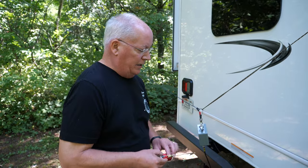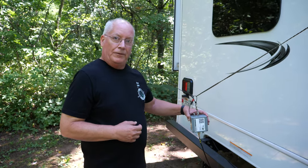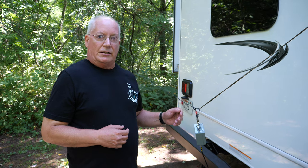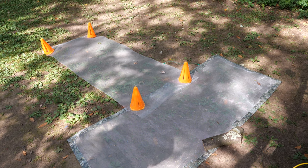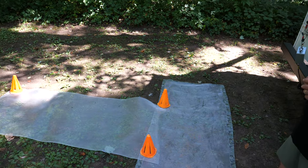So I came up with another idea. Instead of using the coil, a 67 foot wire just happens to be a quarter wave on 80 meters. So if I eliminate the transformer and just hook my coax directly to the wire, I'd have a quarter wave on 80 meters, and then all I need is a ground plane. Well, 67 foot radials headed off into the woods in every direction really isn't feasible. So we came up with the idea of utilizing what we call the magic carpet — and I'm standing on it right now. It's basically an aluminum screen, and lots of guys are using it now with their Wolf River coils, very, very popular.